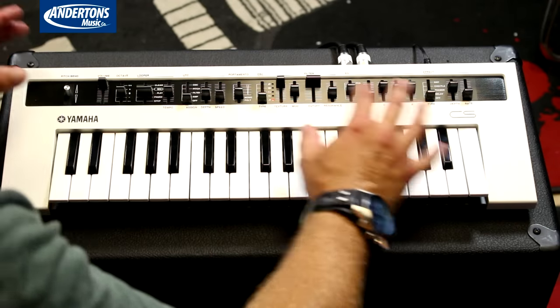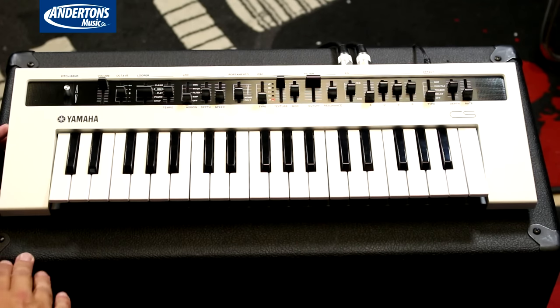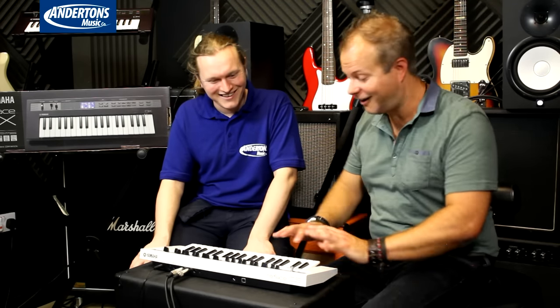Now we've got the CS — I think this one's going to be one of the most popular. Based on the AN1X resonance filters and harking back to the CS analogue range from the 70s. It's gorgeous — you've got all the controls you'd want and it's extremely powerful. Having the filter from the AN1X, it can go down really low and cause some serious air movement and wobbling — it self-oscillates. A lot of systems would self-oscillate around 1kHz, but this one self-oscillates down at 100Hz. It's huge, it belies its size. We plugged this in the studio and the speakers were like — we've got a monster.